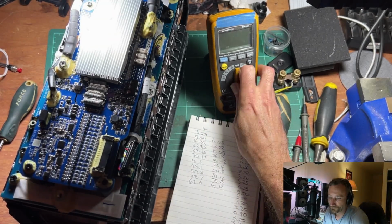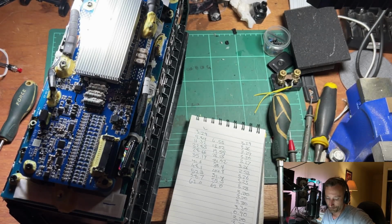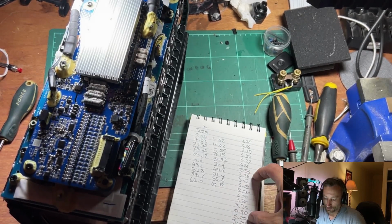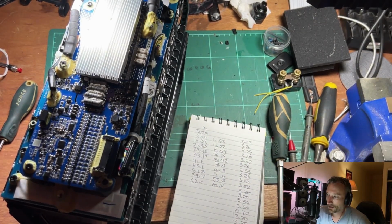All right. Well, that is a bummer because we've got one pack down at 0.9 of a volt and another one at about 2.53. So we've got two low packs. The rest are all between 3.2 and 3.3, which is good. But no, I can't charge it. Can't do the sneaky charge, I don't think.